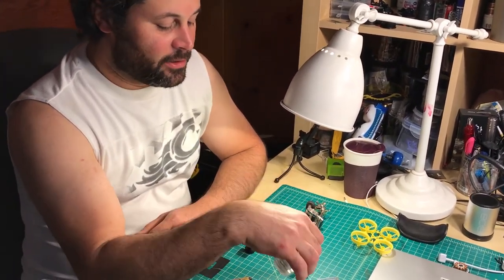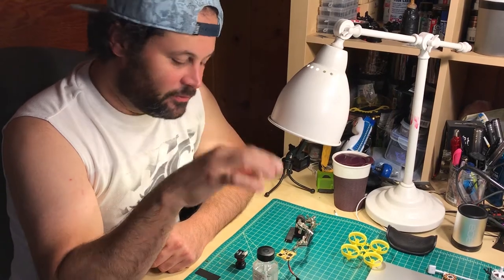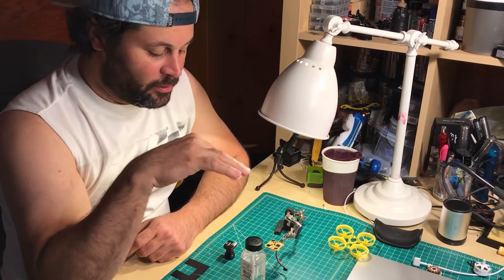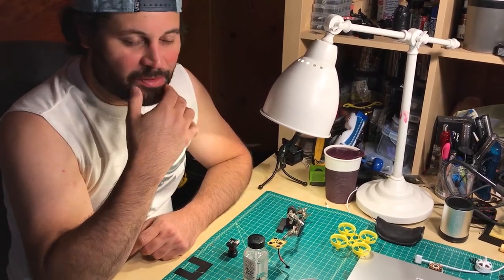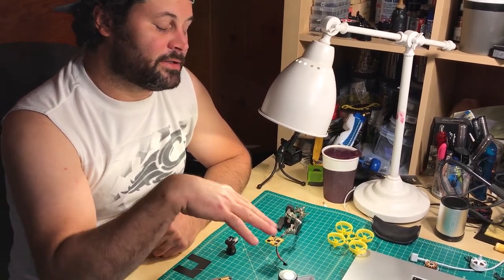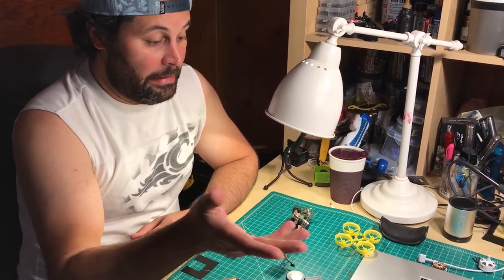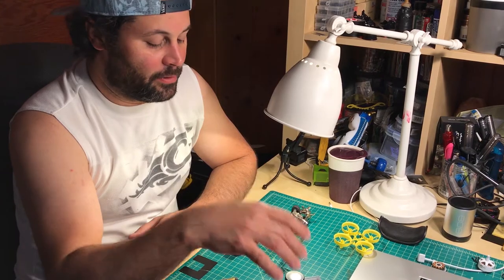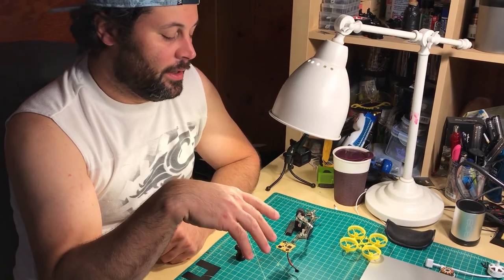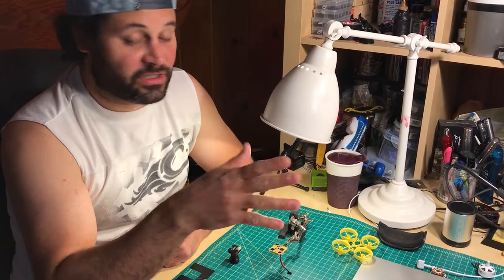The biggest thing I can tell you is that a lot of people put a bunch of it on — no, no. Just clean your brush, put very little on it. You don't need a lot. Just one coat, cover everything, and don't go crazy over it. I've never had a problem where this caused something that works to stop working. Just don't use too much, because eventually when you want to go repair it and solder around it, it'll be too thick and it looks awful too.